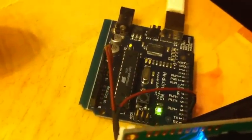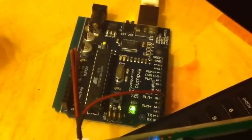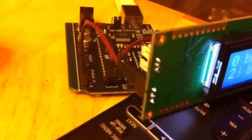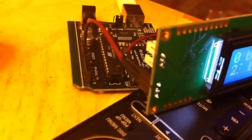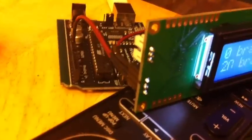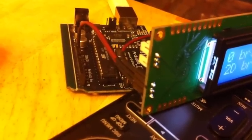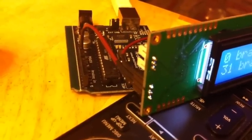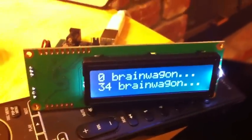The interfacing is just that simple. If you look at the back here, you can see that I've got power and ground, and it just goes to the TX line on the Arduino — so no problem at all. It comes with a white JST header and includes a little pigtail with stranded wire that doesn't really go into breadboards very well. So I went ahead and found a female header and soldered it in, then used some regular jumper cables to make this work.